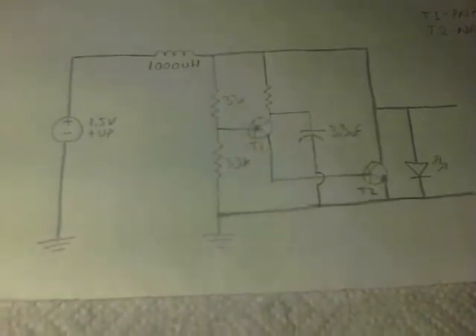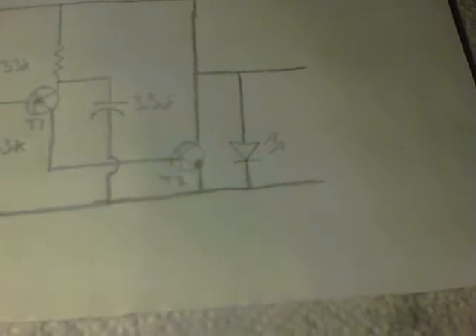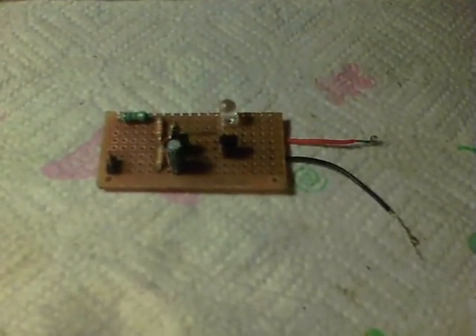My components are slightly different to his — he used 39k resistors and a 100 uH inductor. But the really cool thing is what happens on this end: you put the LED across the NPN transistor, but you can also put a small transformer, and that's what really piqued my interest. At the moment I'm using an A733 as the PNP and a C945 as the NPN, but I'll show what happens with the transformer next.